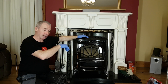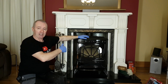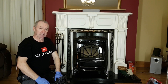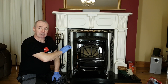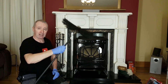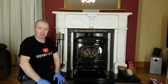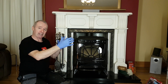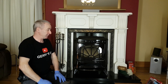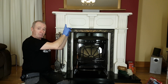This is a boiler stove - it heats the water and also heats the domestic heating system, in this case underfloor heating. It has a boiler built in which outputs about 15 kilowatts, and there's about 6 kilowatts to the room - 21 kilowatts in total. I don't need to take the stove out to clean the chimney. There's a plate at the back and I can get a brush through it and up the chimney. I've got clay liners - eight-inch clay pipes surrounded by concrete going up in a concrete chimney. The steel pipe goes from the back of the stove out and up and connects into the clay liners.